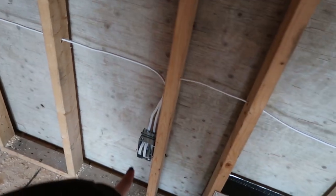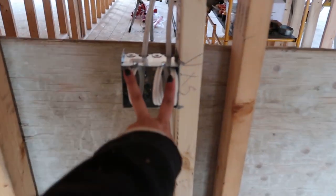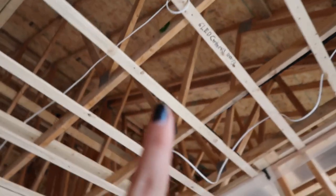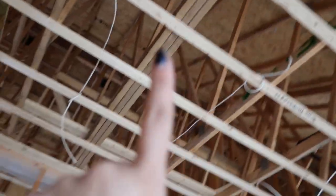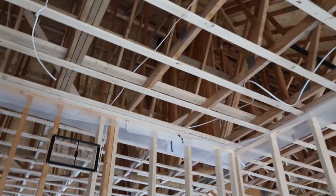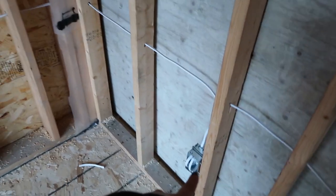My office is complete. We have our home run box there — power comes from the panel into this box, powers two switches, and will run up to power a chandelier in the center. You can also see a long wire in a circle that will power six LED recessed lights.